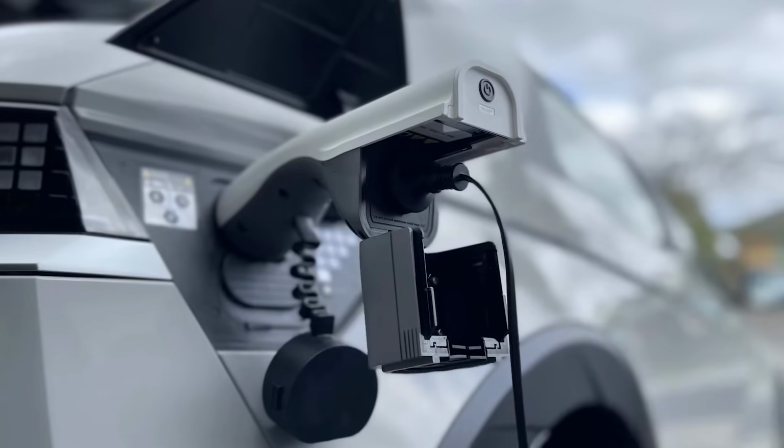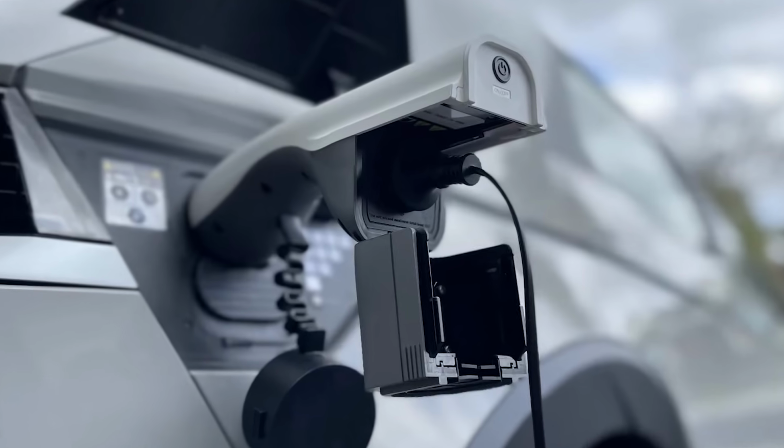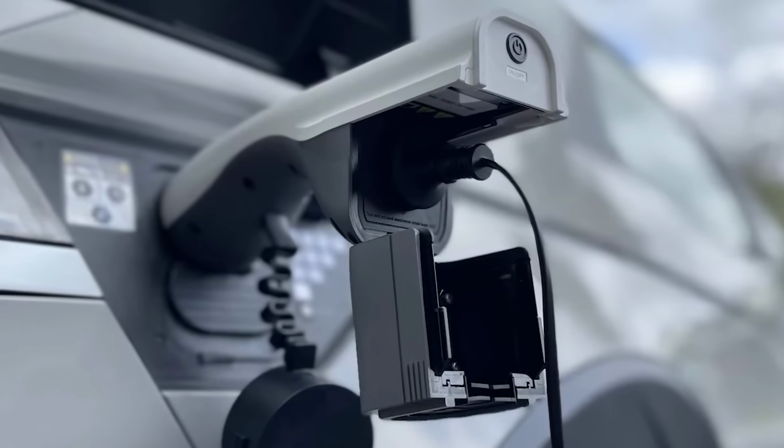Yeah, but I think also the comment is that the inverter has to be built to Australian standards and be a grid-connected inverter. And so you don't have to rely on the automotive manufacturers to build their onboard inverters to meet Australian connectivity standards. This is why, even though things like the BYDs and the Hyundai Group cars have vehicle to load, they're not vehicle to house, because they don't currently meet that standard.